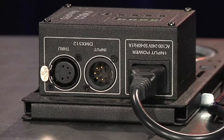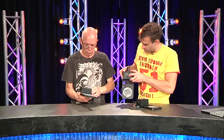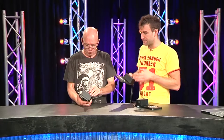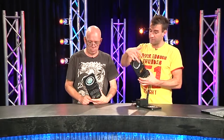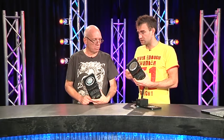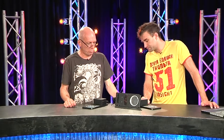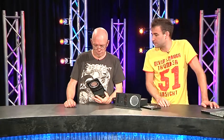The Rev Pro is a little bit different — it has additional modes which allow standalone operation. We've got dimmer options for the LEDs so you can have very dim LEDs and still see what's going on. There are a variety of different control modes: you can run them off simple two-channel DMX up to six channels. In four-channel mode that gives me two channels to control speed and direction of each ring holder — one channel per holder — and then channels three and four relate to indexing position.